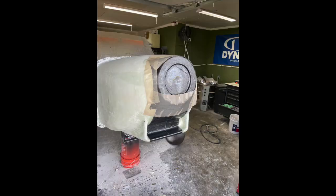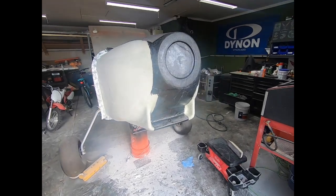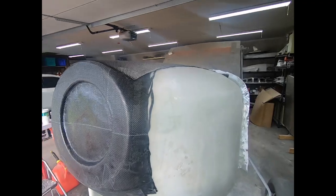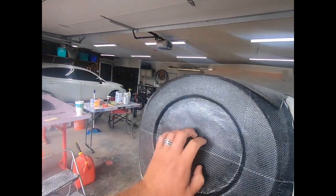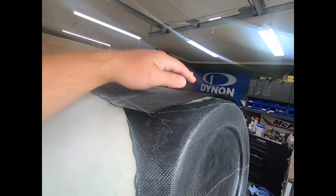Anytime that you do a wet layup with no vacuum bag, you inevitably will have a higher resin to fiber content, adding weight and degrading strength of the end product. To combat this, it's important to keep things as flat as possible as you go along and sand back excess resin as much as possible, enough to just expose the fibers below, but don't damage them. This allows for an optimal mechanical bond to the next layer and minimizes resin buildup.